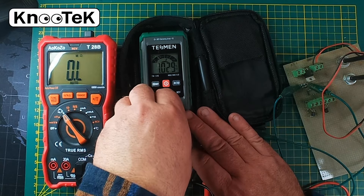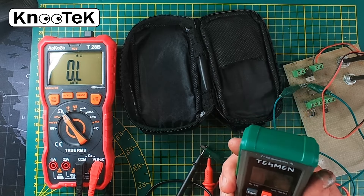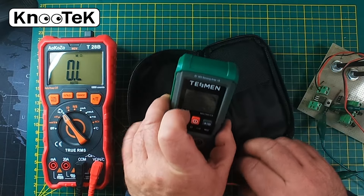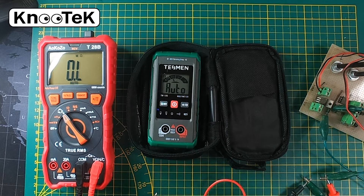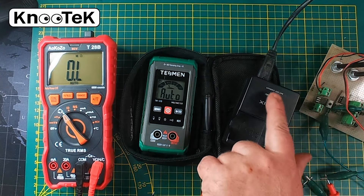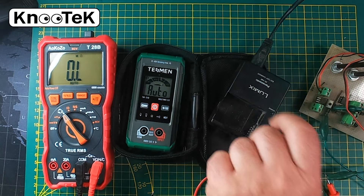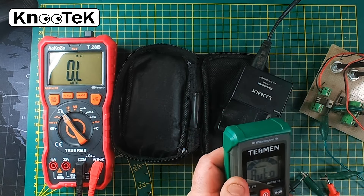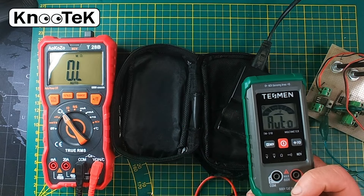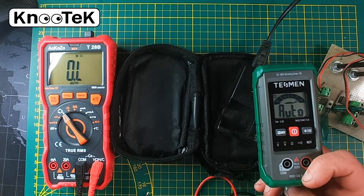So what other features does this meter have? It's got ohms, AC voltage, DC voltage, and continuity — making sure a circuit is complete. It doesn't have all the features of the AOK, but it has another quite useful one. I'm bringing down a charger here because this meter has a non-contact AC voltage detector built in — like the separate probe detectors you can buy from various brands, but it's built right into the multimeter.